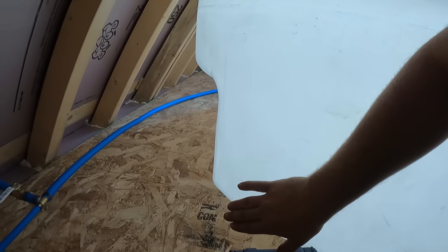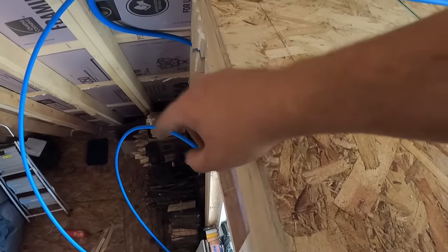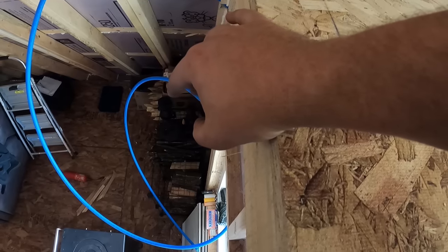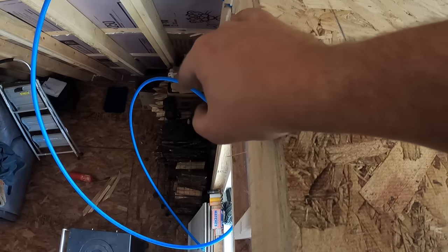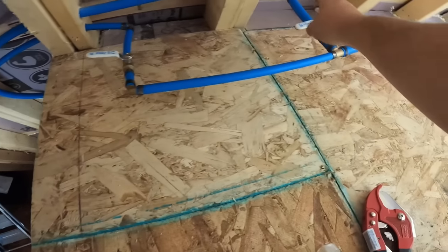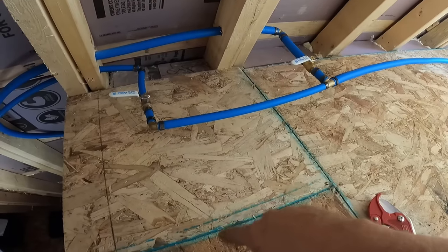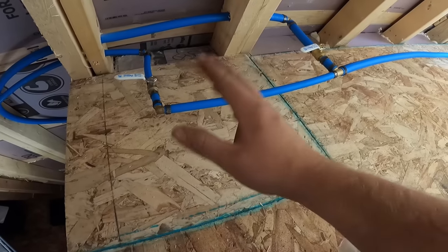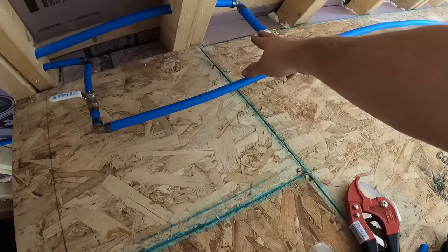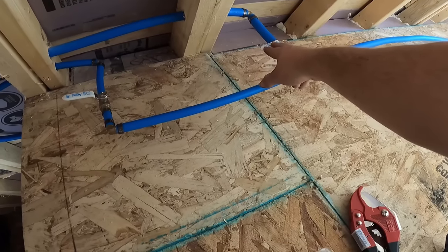And then once we are done filling the water tank, in the summer months, I can just shut off the ball valve that's down there. And that will keep it from draining back out. And then in the winter months, what I'll do is I'll leave that one open and I'll come up here and close this one just so our pipe doesn't freeze and cause a leak or anything there. So I'll close it here for the winter, being we're getting cold now. And then every time we go to fill, I'll just have to come and open this.